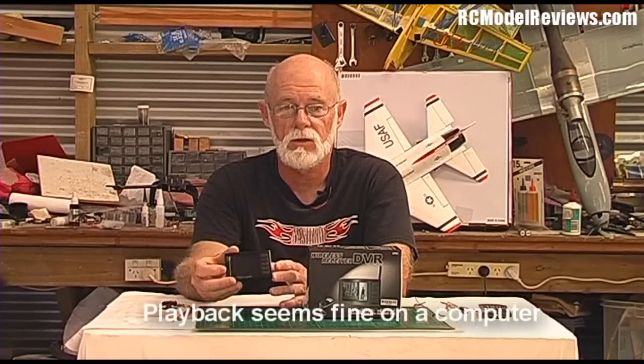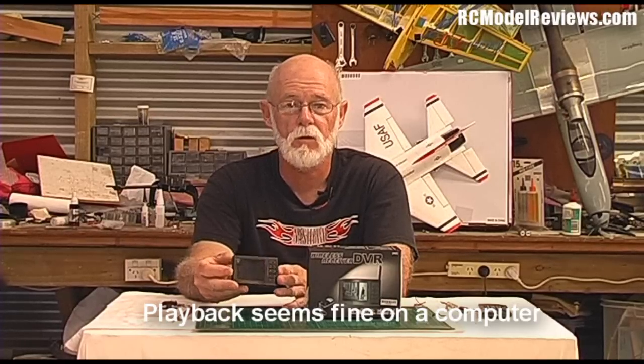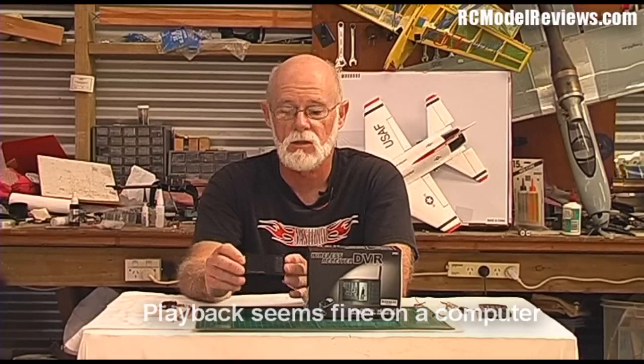But back to this. During the recording, I noticed the frame rate seems to be a little low as viewed on the screen. Maybe that's just a function of the playback. I'm not sure. I'll have a look on the computer and see if it's any better. The quality certainly seems fine. 640 by 480, that's VGA resolution I was using to record that video, which is probably all you get back from a FPV camera anyway. You can go down to quarter VGA, which is 320 by 240. That would save you space on your memory card, but it's going to look a bit blockier, not so clear.